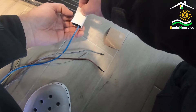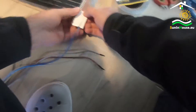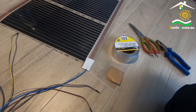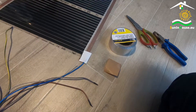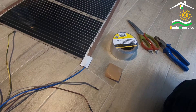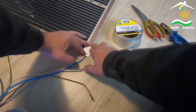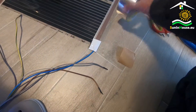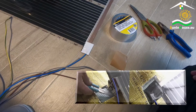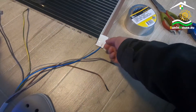In this particular case the foil is placed on the following layers: lean concrete, 5 cm of polystyrene, anti-moisture foil, and ordinary foam for panels. It's worth noting that the foam should be made of materials resistant to higher temperatures. We put the heating foil on top. So that the foil does not move during assembly, we stick it on the edge to the foam using aluminum adhesive tape, which is resistant to higher temperatures. In the foam at the point of contact, cut a fragment to level the foil with the contact where the layer thickness is greater.